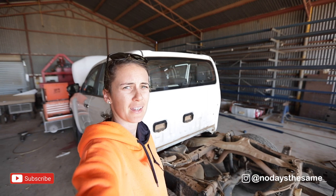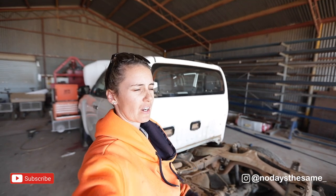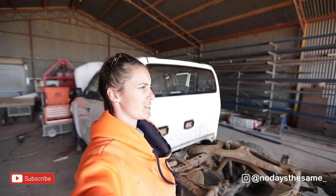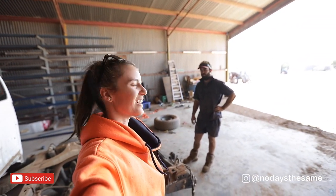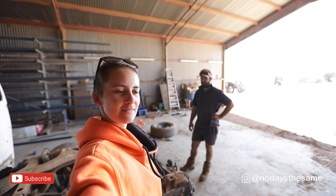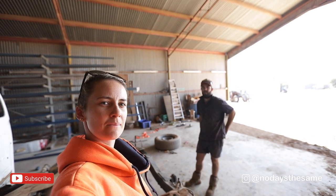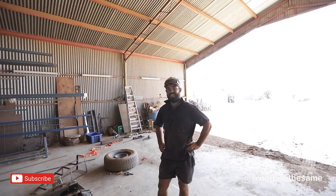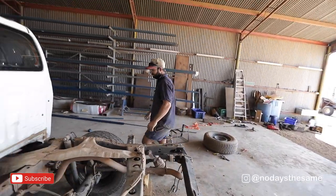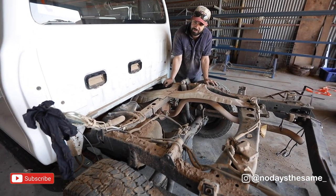We obviously drive this around on the farm and we had this problem of dust getting in the back. It would just fill the cab. We only just recently found the solution, and it was to put the air con on, not recirculate, on the outside air in, so the air gets filtered, comes through the air con and pressurises the cab. That pushes the dust out, not sucks it in, because the cabs on those are pressurised better than the old ones. What he said. I can take it for a burn now and it works.